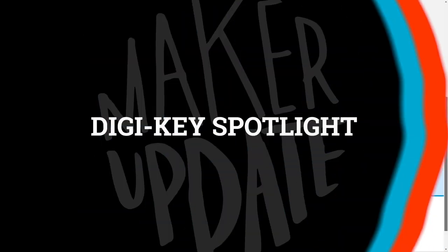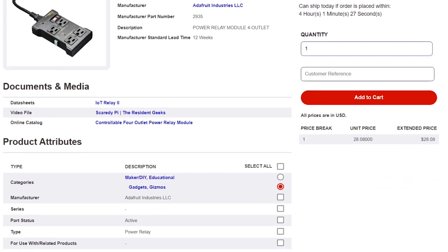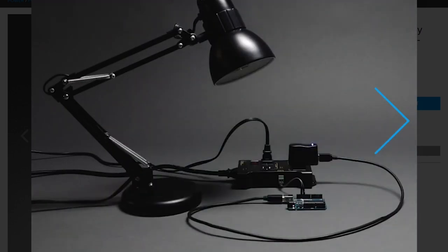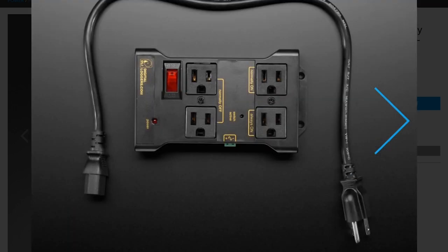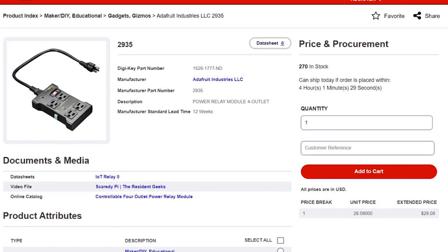For this week's Digikey Spotlight, check out this power strip with an integrated relay board from Digital Loggers. It's one of my favorite tools for Halloween and Christmas projects. You can get it for under $30, and you get an always-on outlet for powering your project board, and then three other outlets that are switched on or off when your board sends out a 5-volt signal. Basically, if you want an Arduino to turn something on and off that connects to household power, this is a quick and safe way to get that done — no splicing power cords, no frying project boards, and it's something you can reuse again and again. You can find it on Digikey using the link in the description.